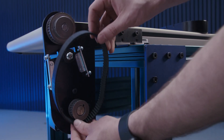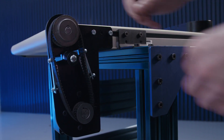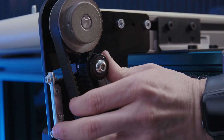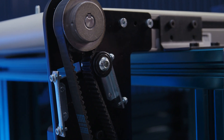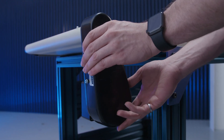Install the belt and using the idler pulley, apply enough tension to the belt so that a force of 4.5N will cause the long section to deflect by 3mm, and tighten it in place. One thing to note is that the tensioner position is driven by the main direction of travel of the conveyor and should always be on the slack side of the belt. Once the driving belt has been tensioned, you can then reinstall the cover plate.